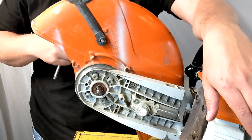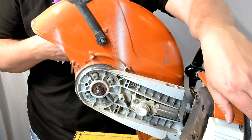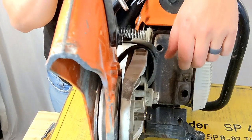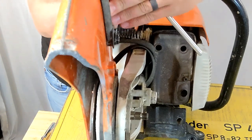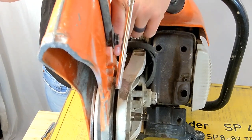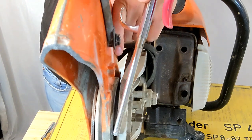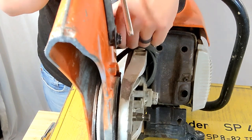You can also clean and service the surfaces between the friction mount to alleviate any frozen action. I've gone ahead and just loosened the four bolts from the cutting arm, and you can see the blade guard has actually just started to fall away from the cutting arm. This gap here is the friction mount — that is where you need to blow out with compressed air all the dust and debris that's collected over years and years of cutting. That should help alleviate any frozen blade guards on the TS series.